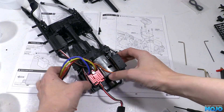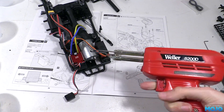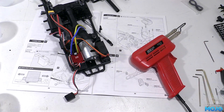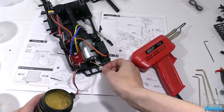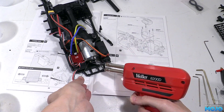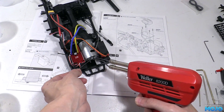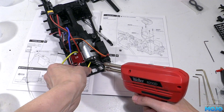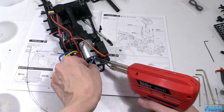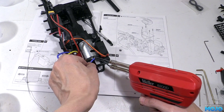For the next part of the install we're going to need the soldering gun. Any large iron with a bit of grunt will do — this gun's 140 watts which makes light work of the motor connections. The motor's been soldered to before so I'm going to give it a little dab of flux on the terminals and flow a bit of fresh solder. Initially we'll just quickly solder the two wires to the motor and not worry which one goes to which terminal. Then there's a little trick we can use to get the motor wires and transmitter channel reverse all set the right way.